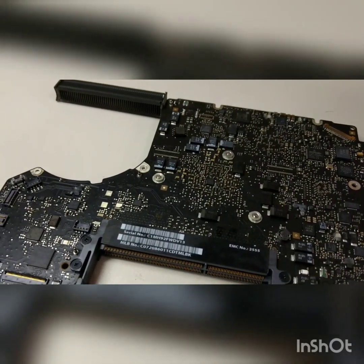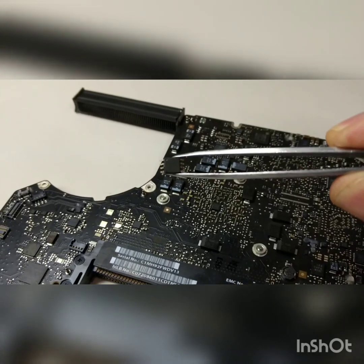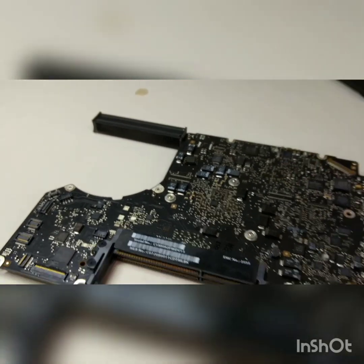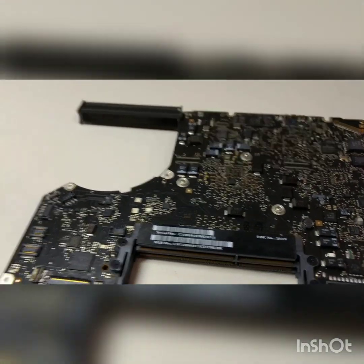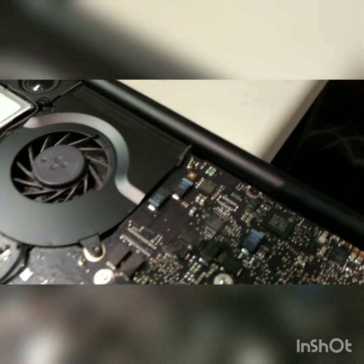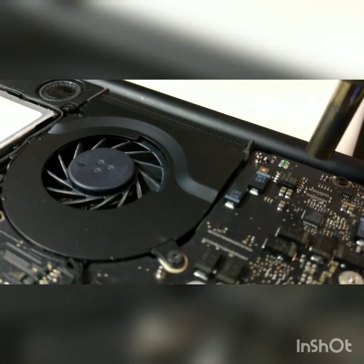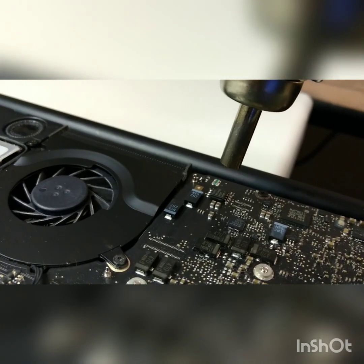The chip on this board has been pulled out, and it is a regular BIOS chip. This board has a problem with it — it works, but it has a problem. So we are going to now take this BIOS chip out by warming up the chip with a heat gun and peeling it out. Simple as that.